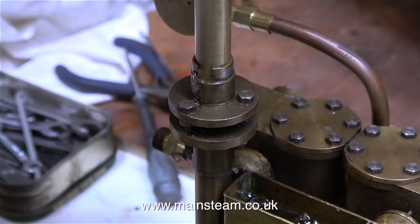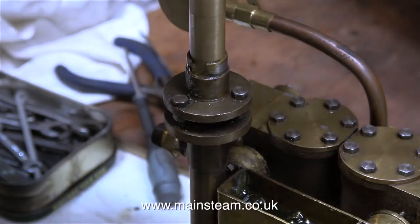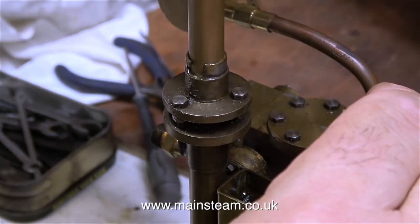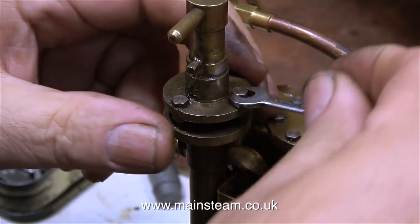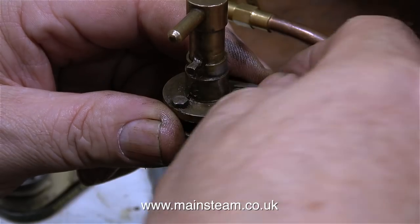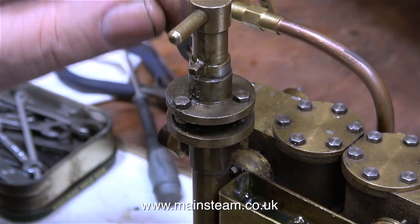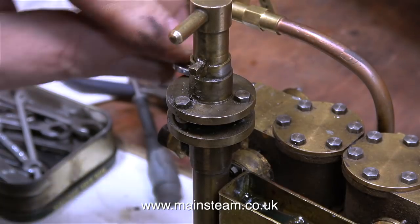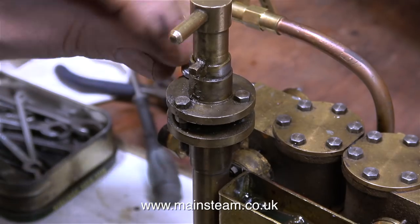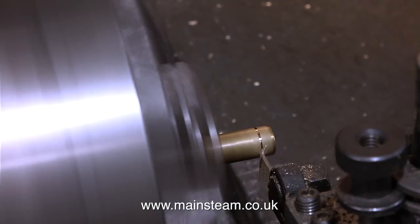There's also a gland on top of the hand pump tube. I'm going to adjust this and hopefully this should stop the leaks. But when I start adjusting it the hand pump ram doesn't feel very good — it feels a bit notchy so I think I have a better idea. I persevered for a while adjusting the ram very carefully, putting equal pressure on each of the bolts, but it still didn't feel good. I tightened up the three bolts and then backed them off but the ram didn't feel good. So here's a solution.